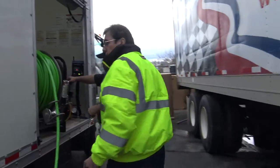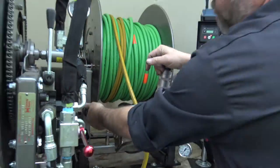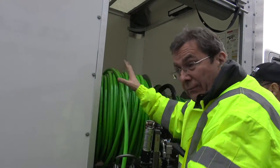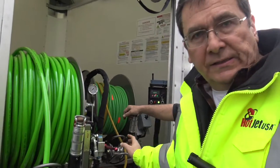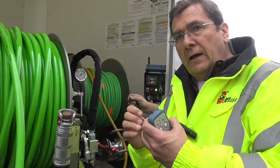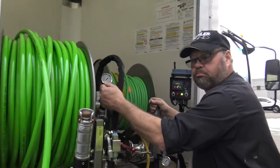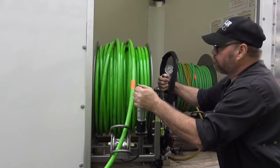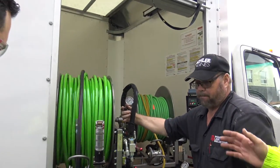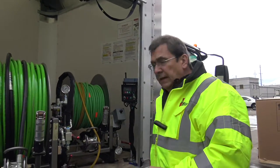Alright, let's shut her down. So when you go to shut her down, when you're done cleaning, I want to throttle down. Go to bypass. This is the hydraulic control in and out — there's out, here's in. Take a rag, clean that hose. I'm a real nut about having your hoses tight. The three-eighths is exactly the same operation. We like to throttle it down and let the engine cool down a little bit. Make sure you put your nozzle on tight — that's pretty easy, use a wrench. We've got to bring that in while we've got the hydraulic power on. That's a sweet unit — made for curbside. That's a nice roll-up door. Any questions, call us. Thanks.